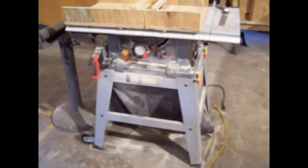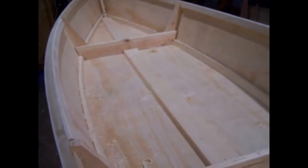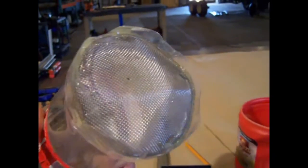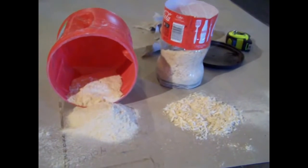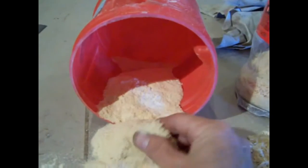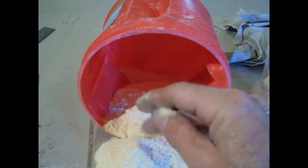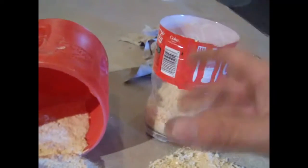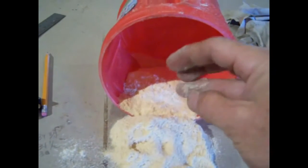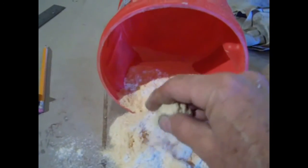My table saw has a bag underneath that catches all the sawdust. To make these fillets with the epoxy to fill all my big cracks — not really cracks, just gaps — and do all the seams where everything meets on the sides and edges. What I did is I took a two-liter bottle, cut a piece of stainless screen, and epoxied it in the bottom so I can scoop up the sawdust, shake it in there to get all the fine stuff, and that's how I make my fillet material. This works really well — I fill that little container I made with the screen about halfway up with sawdust and it makes this real fine powdery stuff, which I'm sure is what they're calling flour. You can buy it but not around here. It screens out all the big flaky stuff, so fill it about half full, shake it like a giant salt shaker into another container, and then mix it with your epoxy to fill in all your big cracks and fillets.